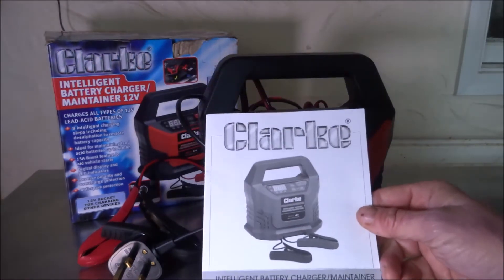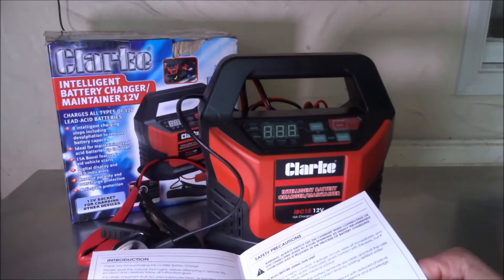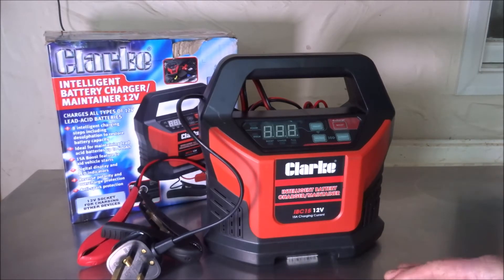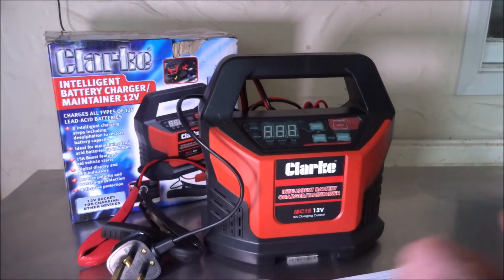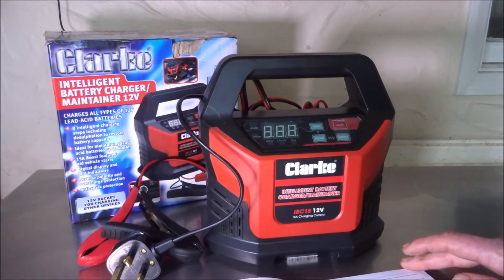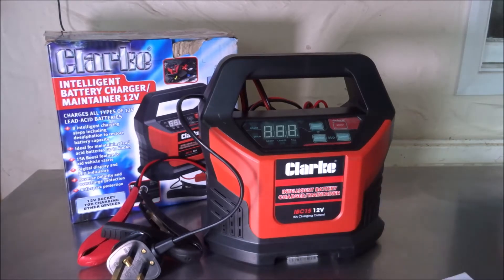The charger is very well packaged and comes with a very good, in-depth, intuitive instruction manual warning you of all safety precautions — as you'd expect with any appliance. Being a battery charger, you always need to ensure it's in a ventilated area. If it's a sealed lead-acid battery that's plugged, that's less of a concern, but always treat a battery as a possible explosion risk and ensure free-moving air can circulate around it.